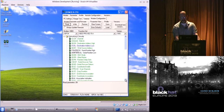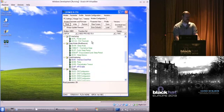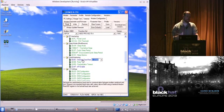And I can come here, other things that I can set up. I can set power levels. I can set sleep modes, which are a really good idea if you want to run it on battery. Again, routers, you can't do this, but every other device you can. And you can set up the baud rate. I currently have it set at 57.6. You could go higher. I just left it there because it's fast enough, and I don't want to go too high and start having possible issues about hardware flow control and such. And it's set to enable the API mode.